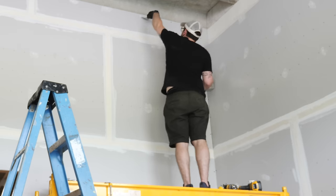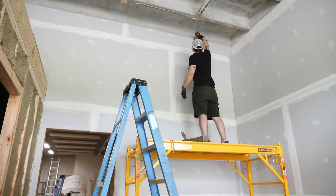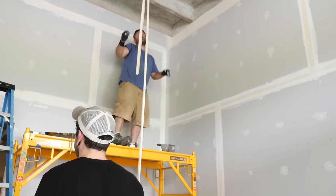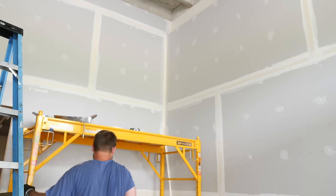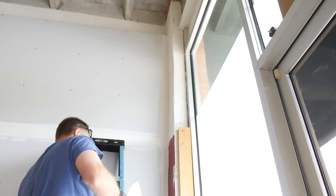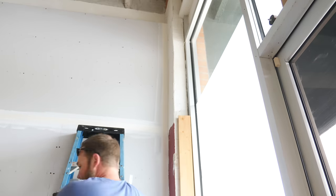I also made sure to double check that all of the screws were below the surface of the drywall, as they'd be much more difficult to hide if they weren't fully seated. The ends of the walls and corners were the last thing to get taped and mudded. For the inside corner, Justin applied mud to both faces, then creased a length of tape down the center before applying it to the seam. For the corner against the concrete wall, he applied tape flat against the panels and used the excess mud to fill the gap between the edge of the drywall and the concrete. After taping, Justin applied another layer of mud over the tape, and then we let it dry overnight.